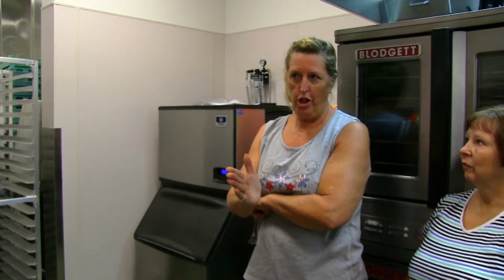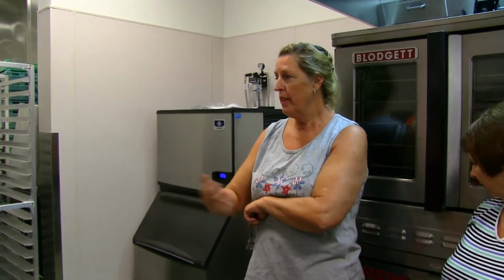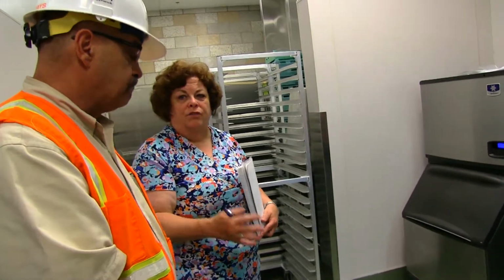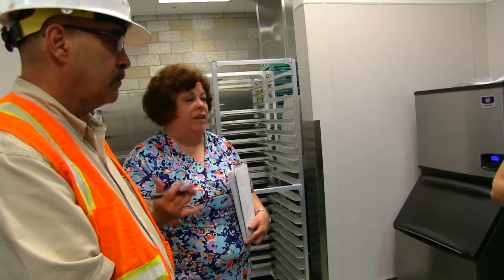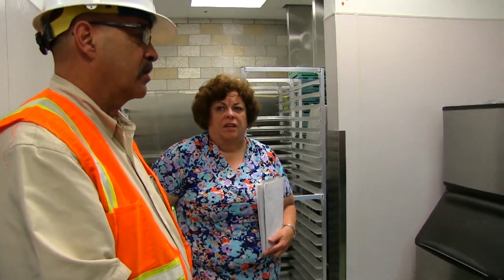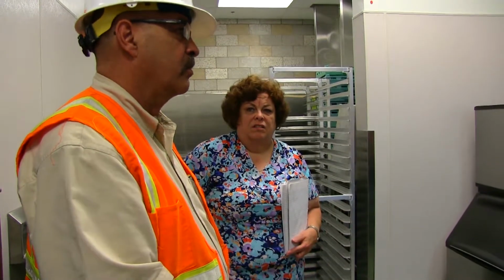That's our job at 6, but we're here before. So what you're talking about is the building's never going to get that cold or that hot, because prior to, let's say it's sub-zero weather, it's already kicking on. It'll kick on 3 hours before the schedule starts. So if you want 5:30, the fan system should have the temperature comfortable for you.